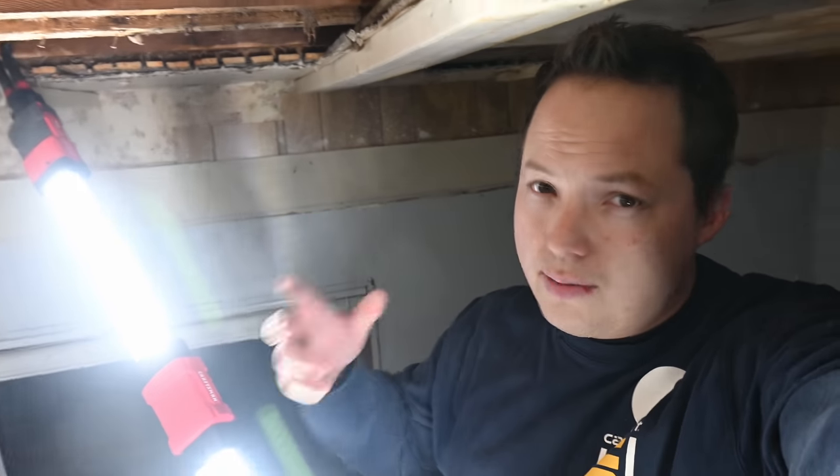In a lot of houses a lot of the lighting circuitry is still being done with knob and tube. And obviously these days with LED lights they don't really draw a lot of current. So it really is not a huge deal that you're still seeing some knob and tube in use because the loads shouldn't be very significant. Now if you're trying to use an electric resistance heater on knob and tube, that's definitely something that I would avoid.